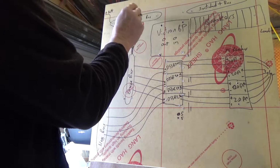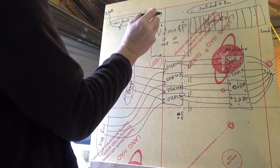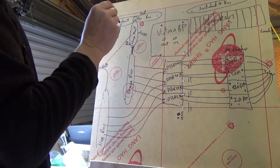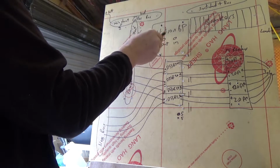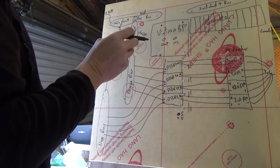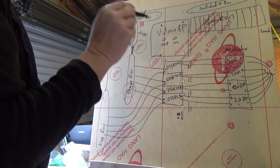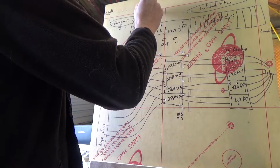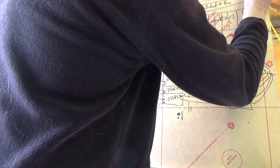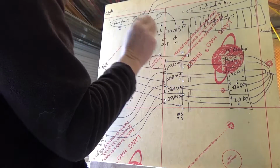Now on the positive bus side, the load side, that will connect to a couple of things. Now I want a couple of unswitched circuits that are not controlled by the Victron Battery Protect. The reason I want that is because I want them to go direct to my inverters, possibly to other devices like that, which I can switch off using the Electrodacus. So I want a fairly chunky thing going out to my main inverter. And then the rest of that power is coming into the Victron.